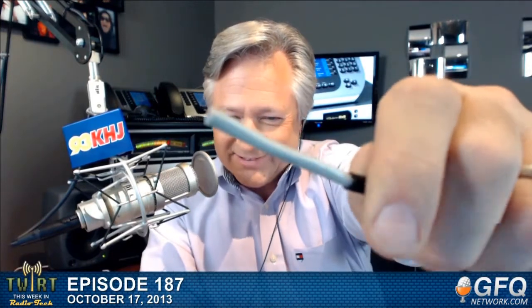So what I do is I take my stripper like this, and I don't close it all the way down. I don't have the right size here to be doing that. There's actually strippers made to do this, and I don't have one of them. So what I do is I score the outer jacket. I score it like that, see? And now you just break it open, and voila, and what are we left with? Oh, not the wires, because this is outdoor cable. It has an extra lining for protection. So it has this extra white rubber lining in it. So guess what? I've got to strip that one off too.